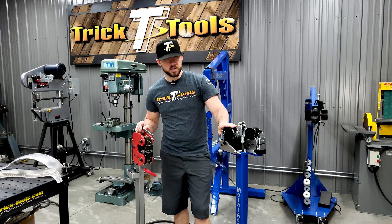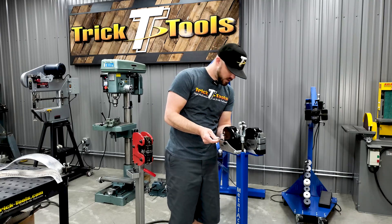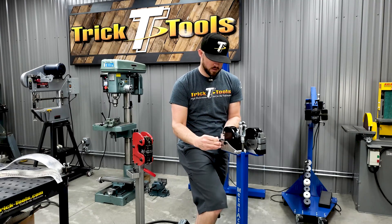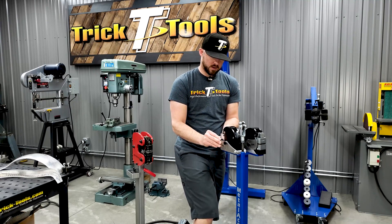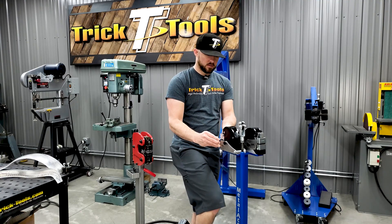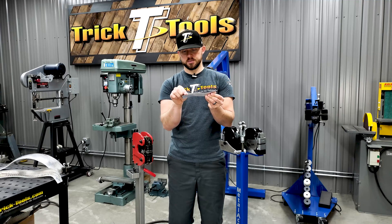On this Lancaster-style machine we've got the stretcher. If you take the stretcher jaws and do the same thing from this side, it's going to stretch this edge and push it around the other way. You have to be careful when stretching that you don't stretch too much too fast, because you'll actually tear the metal. You can see how stretching this edge did the same action but stretched the metal out here, creating the same curve in the opposite direction.